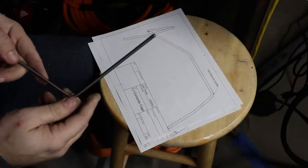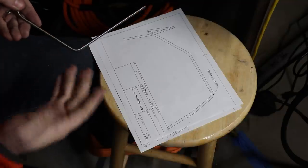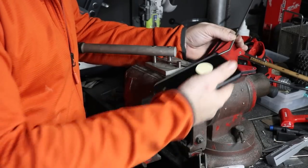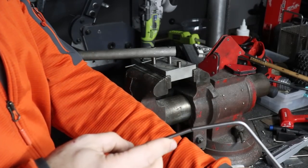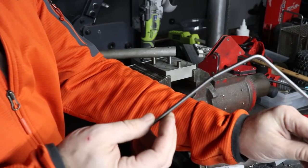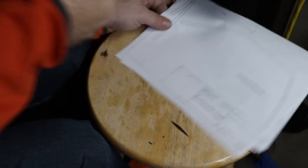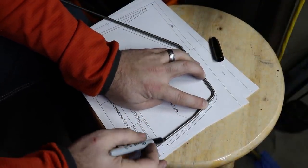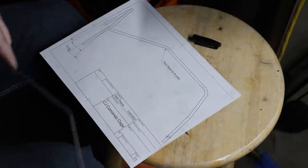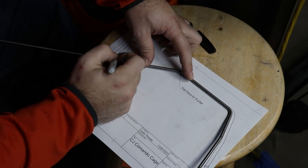Now we're going to put this side of the bend up by about 12 degrees. I just held my phone in place and used my body to move the bender itself. But just visually staring down the tube, things are looking proper. Pretty excited. Now we just have to check against our third template — ever so slightly overbent. Pretty happy with that one. Now we get the fun part of cutting this to length — a 16th to an 8th past where the actual end will be on both sides, marking those using the bend plane that the closest bend is in. I'm using a 3-inch electric cutoff tool.